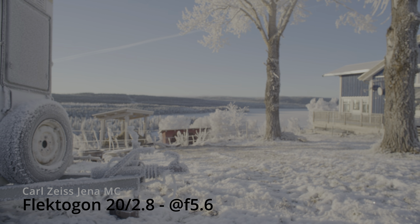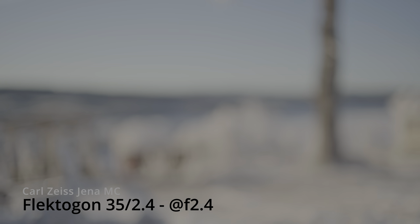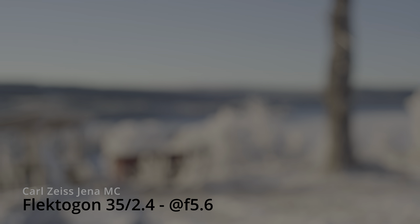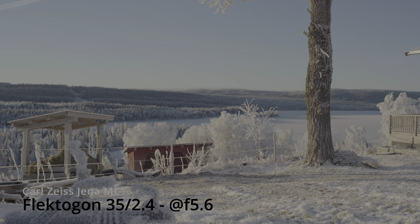So here we're going through a little bit of a ramping — I'll explain it again later. The grease used is relatively easy-flowing, but the colder it is, the more problems you have. The MC lenses are also all really solidly built. You still have a little bit of tolerance issues — they are vintage lenses, so that usually happens. In my case, they're not all going the same way as each other.